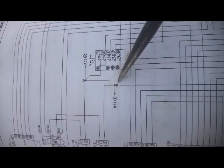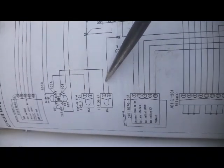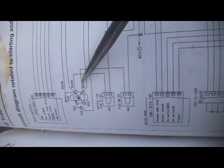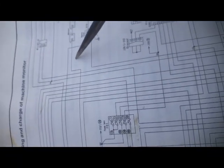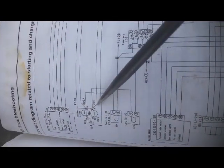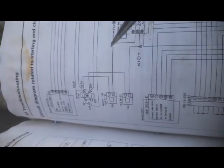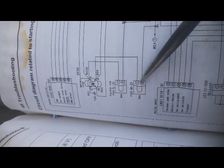Tracing further back in the diagram, I find fusible link F05 and then the battery relay. Wire R04 goes from the battery relay to fusible link F05, and from there to the batteries. I confirmed the batteries are good. Now I will physically check wire R04 first and then fusible link F05.